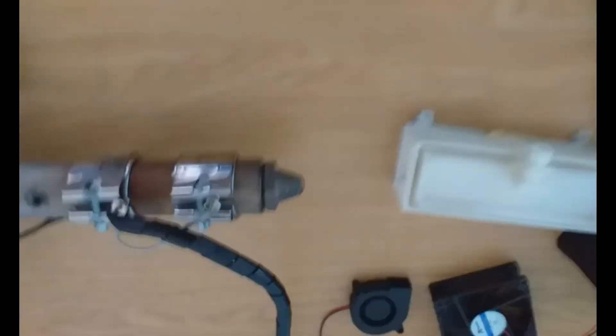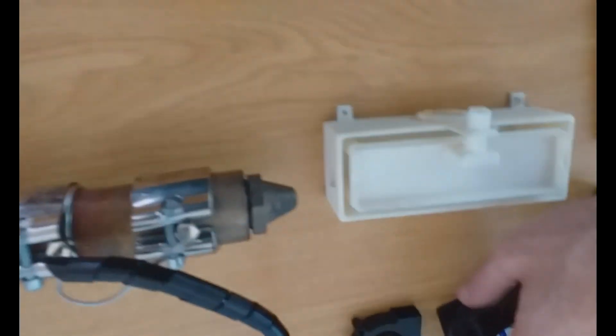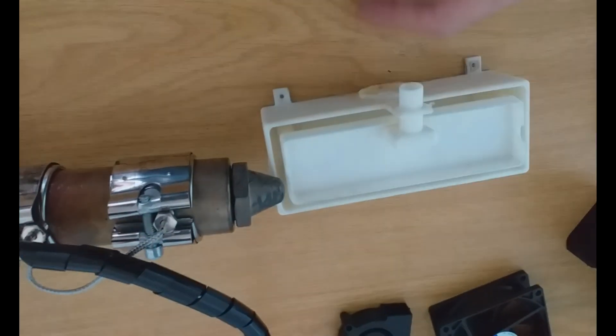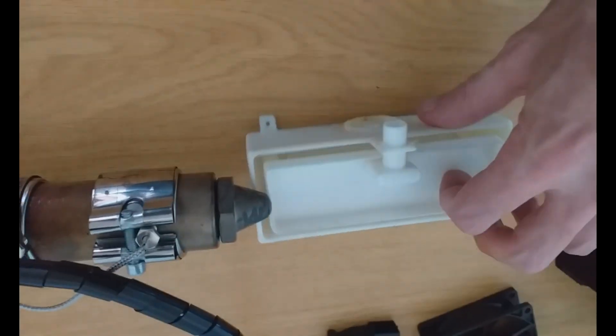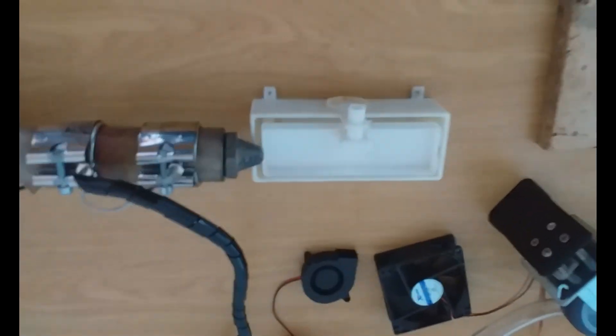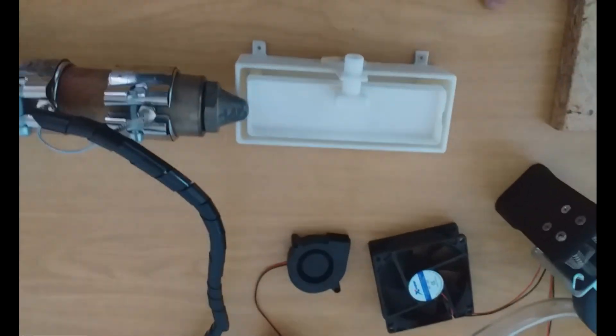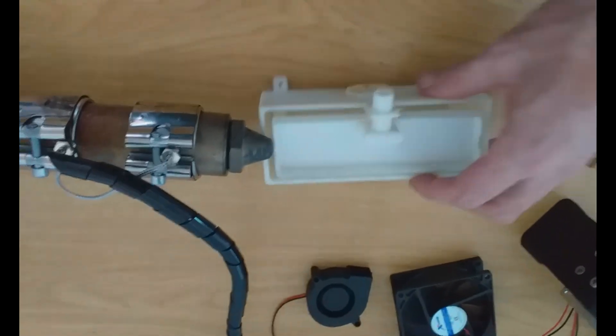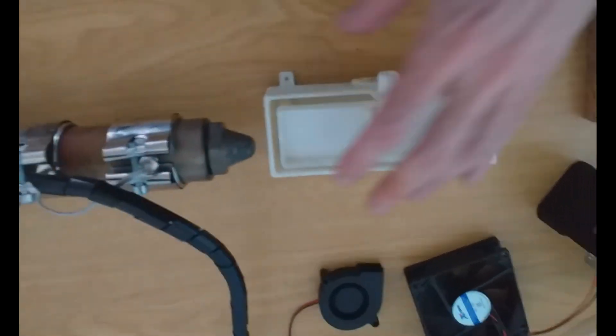You'll cool the filament and then you need to roll it up onto a roller system. To cool it down you've got a couple of options. The most commonly used one is to use a water bath - water flowing through there - that's quite commonly used. You might think you don't want to mix PLA with water, but that's what they do in the factories. They've actually got huge water baths, not small ones like I've got.